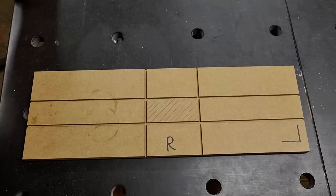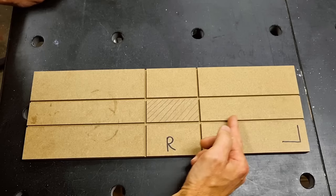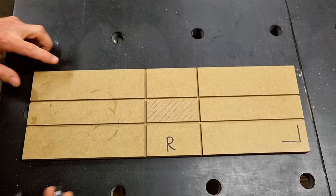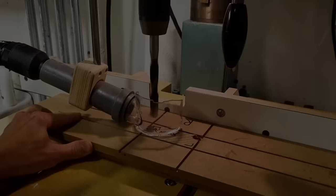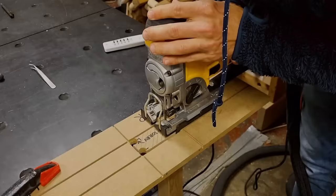That was the four scoring passes. If you miss your lines slightly you can always adjust outwards, but you can't adjust inwards. Since we used the reference side for all cuts, the two long lines are parallel and the two short lines are at right angles to the reference surface — giving us an inner rectangle with four square corners. Then I drill holes in the corners to enable jigsawing in the next step. It's okay if you drill into your saw grooves, but don't drill outside them.